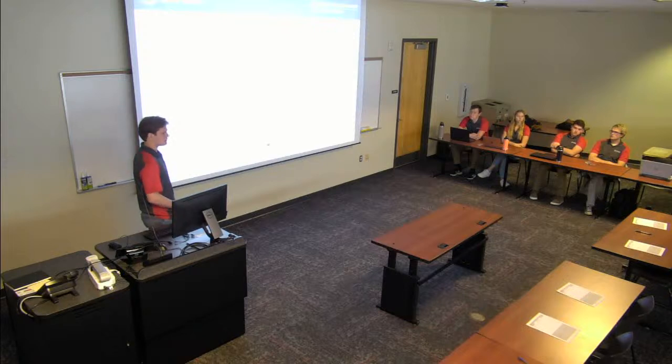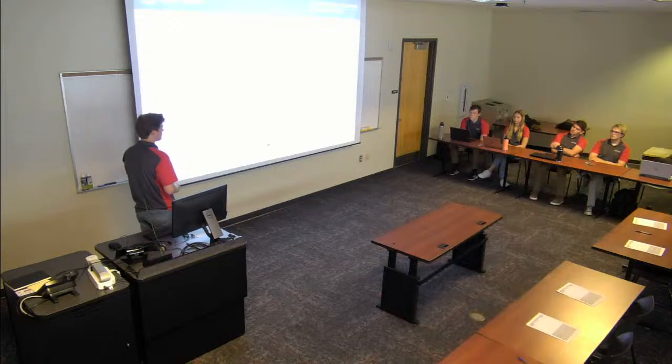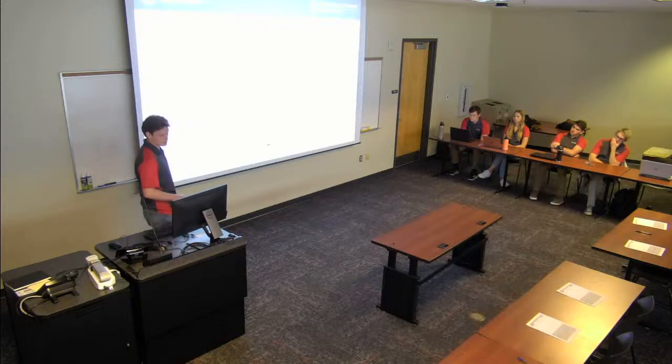That's 4,028 newtons of average thrust. You can see here we have the 4 inches and the 60-inch propellant length. Usually we go with 48 inches of propellant length, so it's quite a big increase, and you can see that in these numbers. The total impulse is pretty large. It's about, I think, 3,000 more than the 98 millimeter, so it's about 24,000 newton seconds. Max thrust is also large, 5,100 newtons. Burn time is pretty standard, 6.11 seconds.